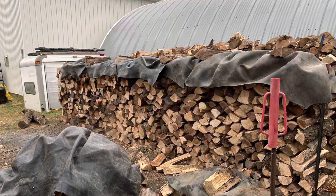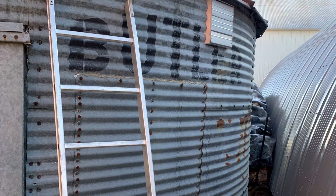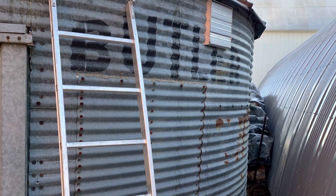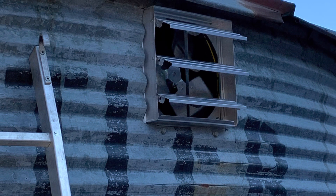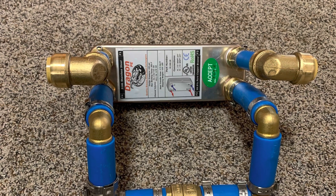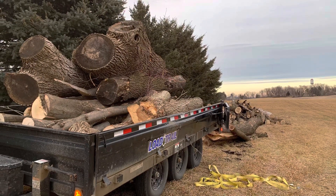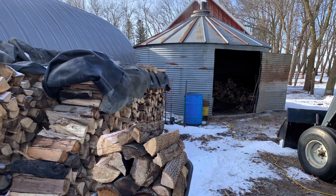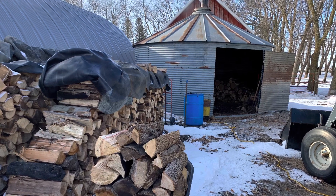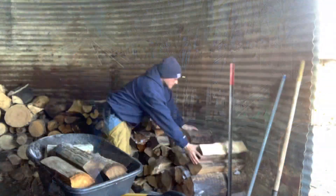Some shots of firewood. I also cut in an exhaust vent inside the bin — this is convenient, but it does get filled with smoke quite often. Then I made a plate heat exchanger for my domestic hot water. How the system works is there's a firebox surrounded by a water jacket, and that water jacket gets heated up and pumped through lines to the other heat exchangers.